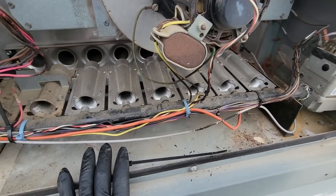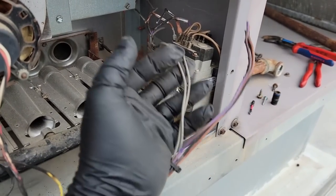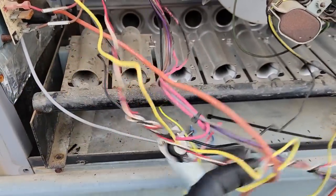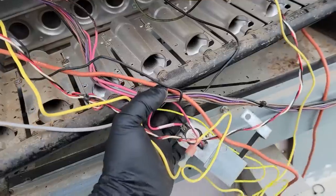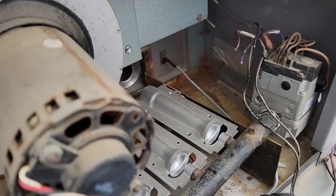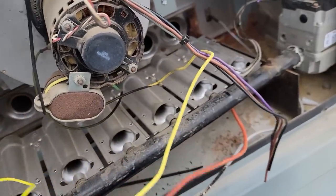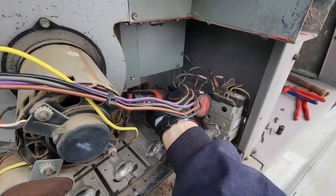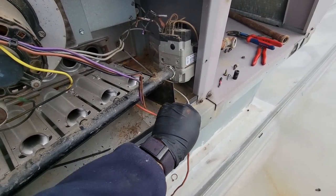When you kill power to it, it's going to reset and try again — that's just so dangerous. Tried to unscrew it and that didn't work. Since these wires are burnt, I went ahead and cut them — that'll tell me where they need to go; they can be repaired. Also chopped the flame sensor wire because it was too long anyway. Maneuvering this out of here, getting all this stuff out of the way. Trying to pull it out in one piece so I don't snap it off in the valve any worse.